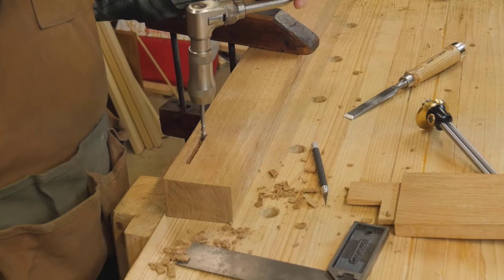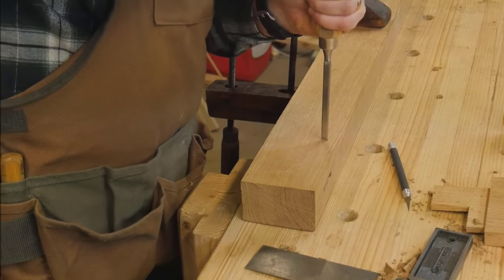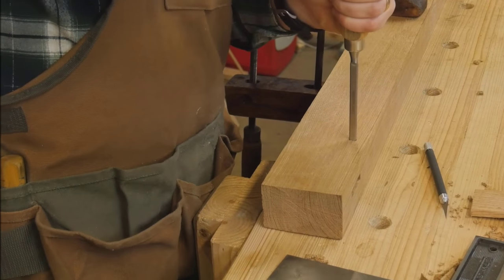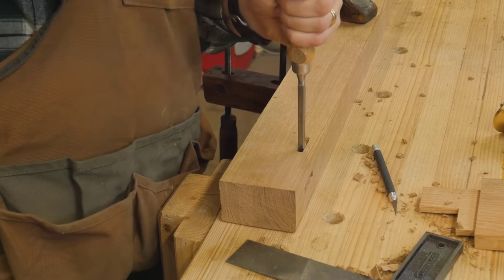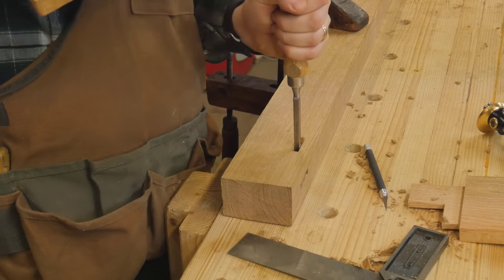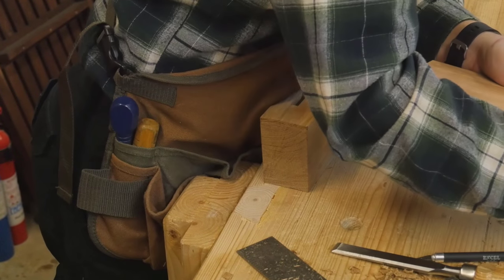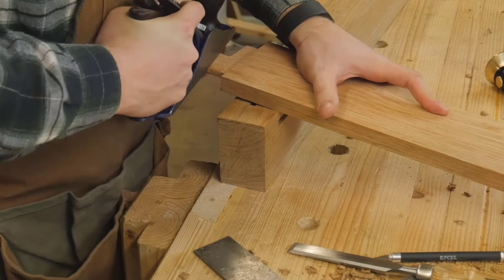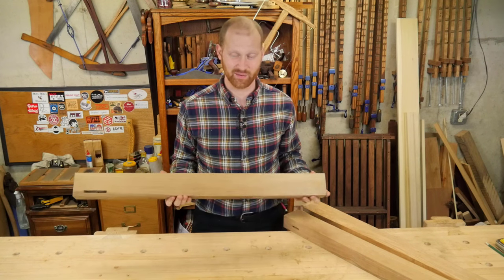I like to drill once I've carved a bit of a trough, because that holds the bit in place. Then I flip the board over and chop from the other side. Once you finally start to break through it becomes a lot of fun, and it's just cleaning up the hole. My tenons don't always fit perfectly the first time — most of the time I have to fit them in and make tweaks. This particular one I had to pull out a couple times and thin up the tenon or adjust the mortise.